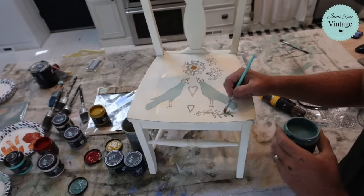Susan says, I put a transfer over cottage color. What should I seal it with? You can seal it with anything. You can use clear wax. If it's going to be high use, I just throw on some Big Top. Just know if your sealer has a lot of smell to it, like a high VOC sealer, it doesn't play well with the transfers. Yeah, you want it to be water-based. So use the sealers that we carry, because I for sure can tell you they'll work fine.